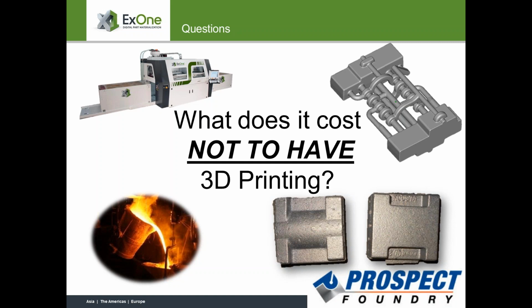As far as core breakage, I would say just the opposite. Because this particular job's cores are so small and the passages are so small, we have chaplets on this job, and with the assembly of 4 cores being put together and the variation, we were having more core breakage because of that variable. With the ExOne cores and the repeatability from a dimensional standpoint, the core breakage went down to next to nothing because the chaplets would kiss. The repeatability of the chaplets kissing the core was there time after time, so core breakage was actually reduced.